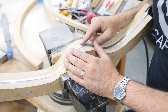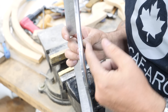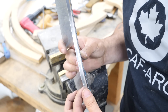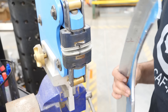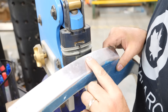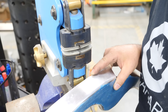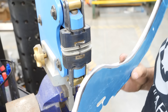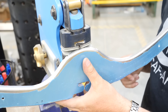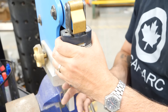That's about as good as I can get it with the MDF behind it — it's a little bit soft. You can still see those ruffles that need to be shrunk more, and the part is bowed because even with those in there it still needs to be shrunk more — there's too much material along that edge. These are the best dies I have for doing shrinking; they worked beautifully for finish, but the limitation is the width of them. When you get into really tight curves you'll end up marking, flattening, and just destroying your material. As you can see, these dies wouldn't actually fit and they'd flatten the part, so it's impossible to do what we want with this set of dies.